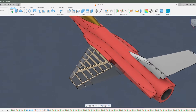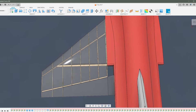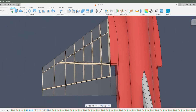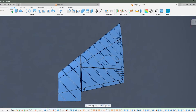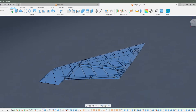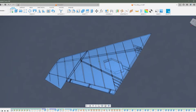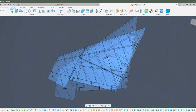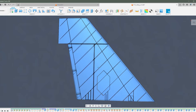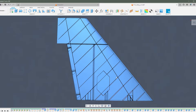We're back in the Fusion 360 model. This is what the wing was originally going to look like with the fiberglass skins and internal wood structure. But now that I'll be 3D printing it, this is the new model of the wing. I'm planning to print it out of lightweight PLA with 0% infill and just one wall. I had to design it in a very particular way. First off is maybe the most obvious difference — the ribs being at 45 degrees. I can't print with supports, so if the ribs were horizontal it would need to print using bridging, which wouldn't result in clean ribs. Plus, with the ribs going along the span of the wing, it will help support some of the bending loads too.